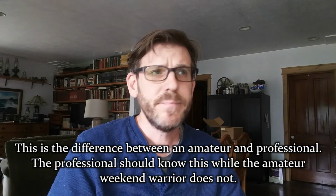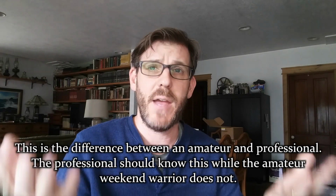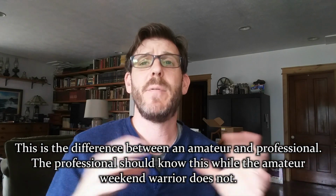So what I did is I decided, hey, the system has failed. I have a cascade failure. I got a pressure tank that failed. I got a cistern pump that has failed. It is cascade failure time. It is game over. I got to do something different. And on the last 2 days of school, I ripped out the cistern pump and the pressure tank, and I moved it to the pump house. I got a smaller pressure tank and replumbed the whole thing.